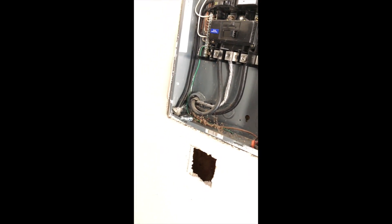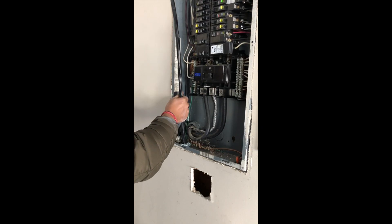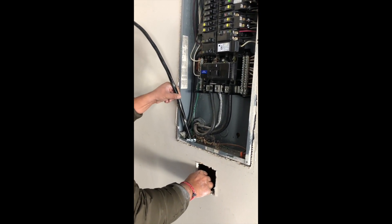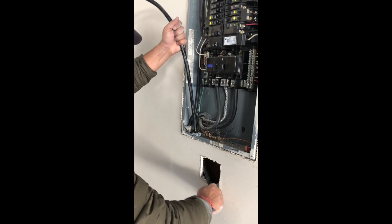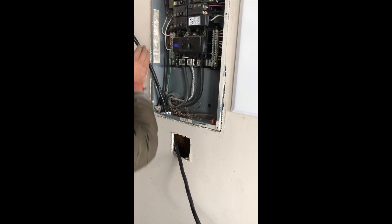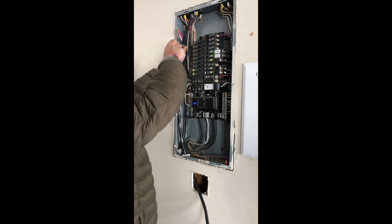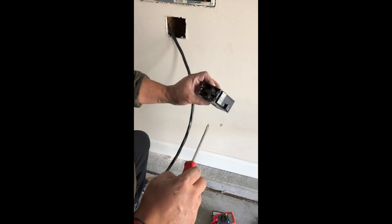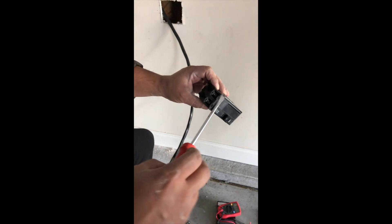But this portion you do not want to touch — do not get anywhere close. If you have an outside disconnect board, you should use that to cut the power. This is how you're going to run your wire — just make sure you have enough coming out. We have a lot of wire so I'm going to install the circuit breaker. We'll put this wire into the circuit breaker and I'll show you which ones.